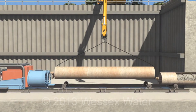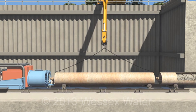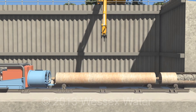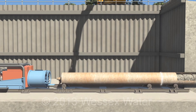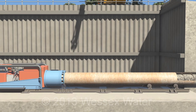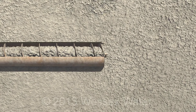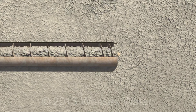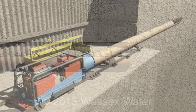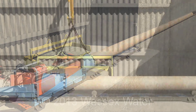When the first pipe is pushed all the way in, the rig is moved backwards on the rails and a new pipe is dropped in front of it. This new piece of pipe is fastened into the previous piece and pushed forward into the ground. Every time a new length of pipe is added, the front is pushed further underneath the obstacle, with the auger moving all the debris. This is collected in the pit so that it can be lifted clear during boring.